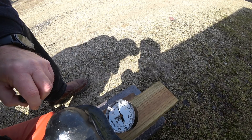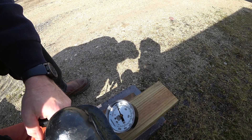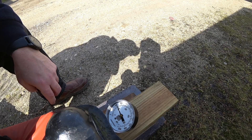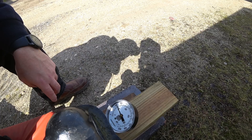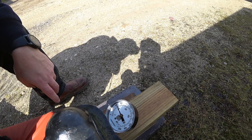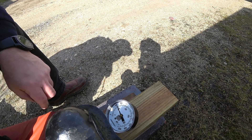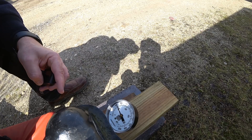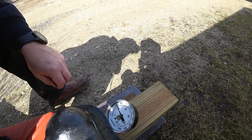As the fluid has been getting warmed even more, the tongue weight now reads 450 pounds. That's pretty accurate — the RV weighs 4,300 pounds empty, and 10% of 4,300 pounds would be 430 pounds. So we're right around there, just a shade under or right at 450. This scale has about a plus or minus 50 pounds. I'm going to walk up the steps and then walk to the front of the RV as far as I can, and we'll see what that does to the tongue weight.